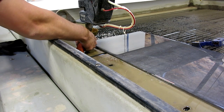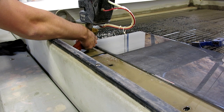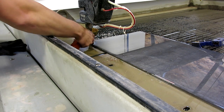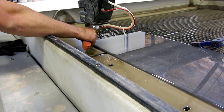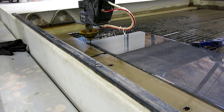This is our tool. We're going to basically set it down there, and then use the page up and page down on the keyboard. Get it real close — it's a pretty fine movement, just hold it down. Use page up and page down. There you go, a little bit more. Once that's there, you can push the zero right there. Then we also want to set our zero there. I'm going to turn on the pump. Last time we forgot to turn on the garnet, but I think we got it this time.